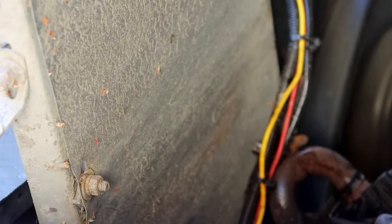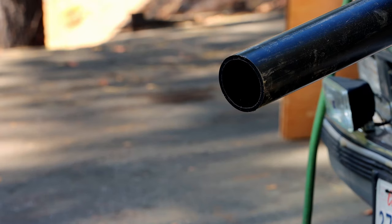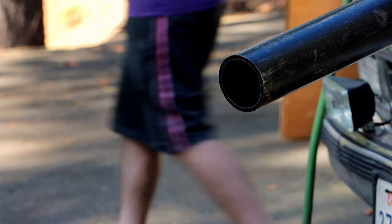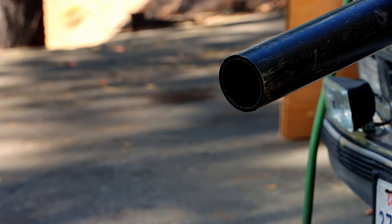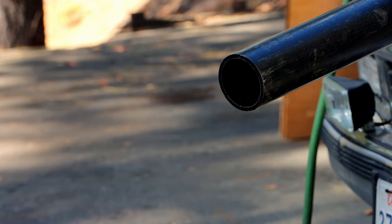It's spilling out all over the ignition coil, so let me toss in this mud flap to deflect the water away so my spark plugs don't end up lighting off poop bombs in my engine. I've got a garden hose now feeding water into the radiator via the filler neck, and let's take a look at what drizzles out of the engine block as fluid is forced through the thermostat and out the upper radiator hose. Yep — more post-Taco Tuesday fallout.